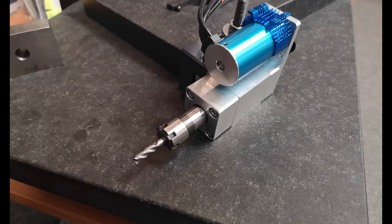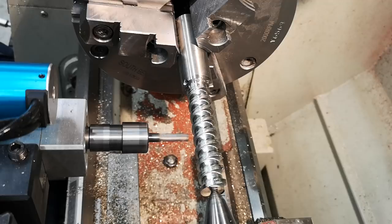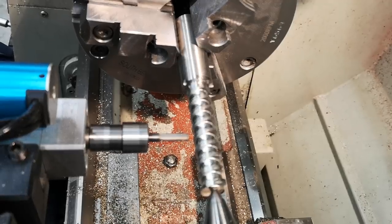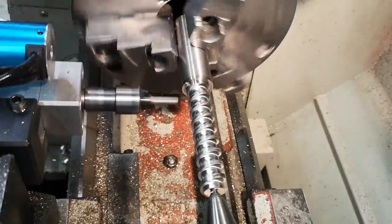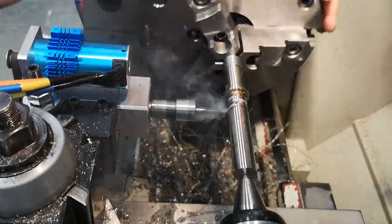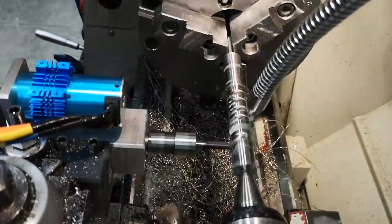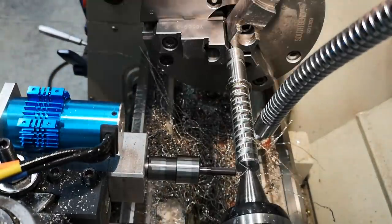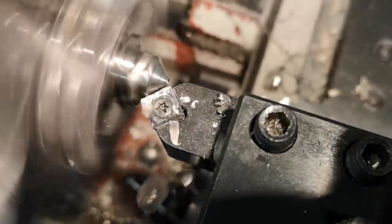When everything was assembled, I put it on the tool post, dropped it below center to avoid center cutting, balanced the power supply on the tailstock, and gunned it. I used scrap end mills because our shop has high standards for end mill condition and this is at best experimental. The surface speed was way too high, but the motor lacked torque at lower speeds. I found the best way of removing material was plunge milling and then cleaning it up with shallow passes. Overall, it did work — it was just a little scary.